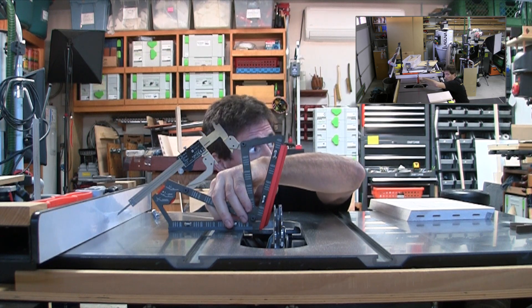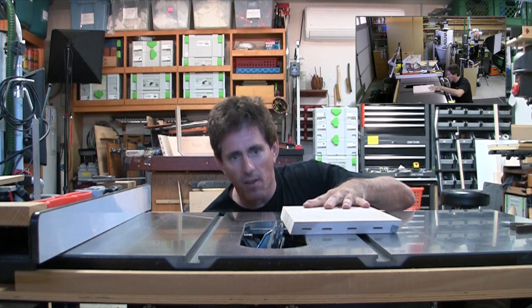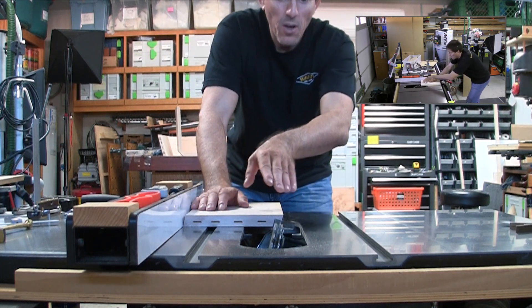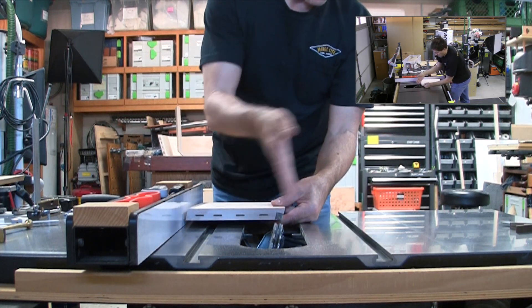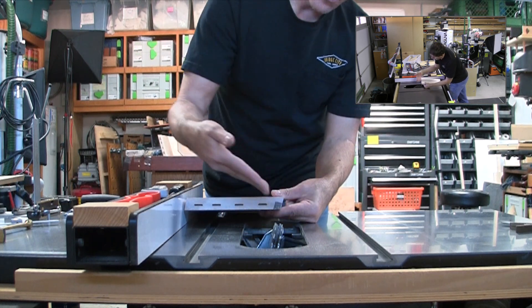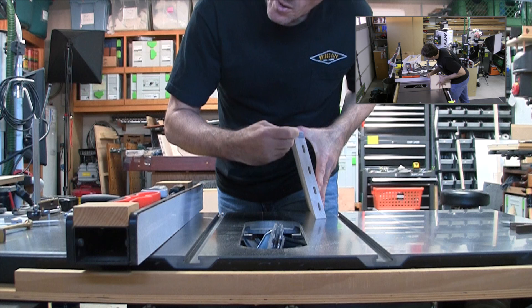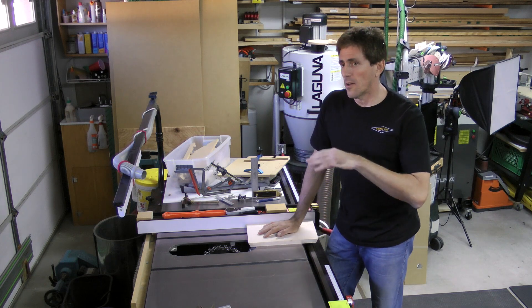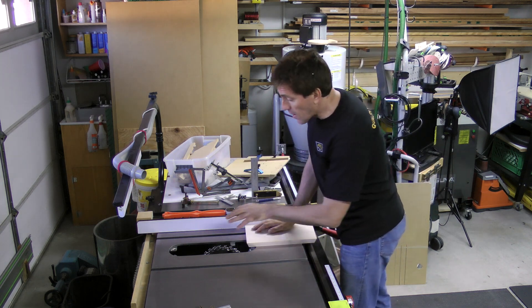This is actually the first time I've ever tilted a dado stack. Now it should be clear from the other camera view that this is going to make the correct type of cut: the flat top of the dado stack — because of the way it's angled — is going to give me that angled-down edge. When it's assembled, the notch here goes down straight plumb, so the square edge of my panel is going to fit in there just fine. I won't have to put bevel cuts on the panel — I'll just unfortunately have to do all eight cuts around and get them to fit perfectly.